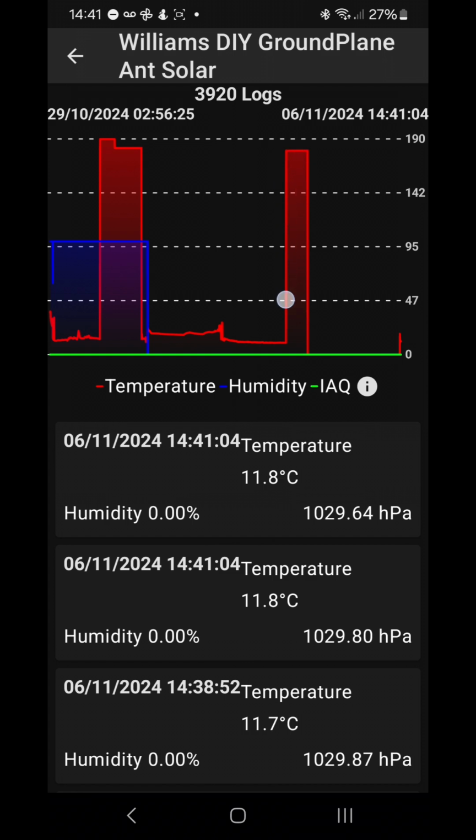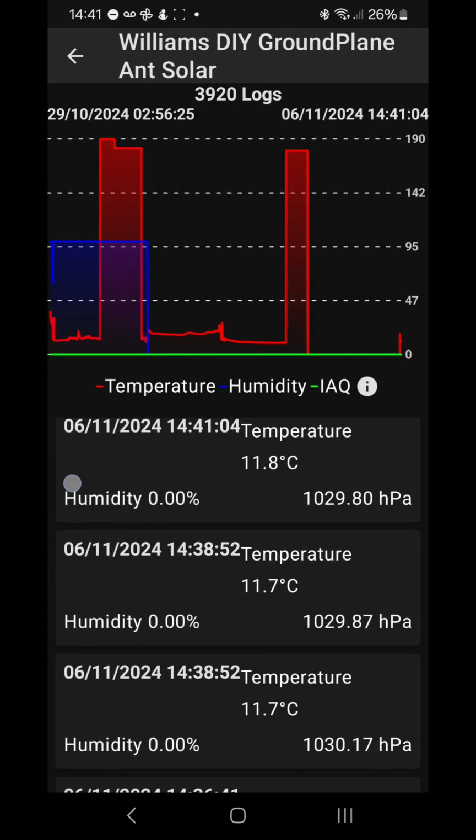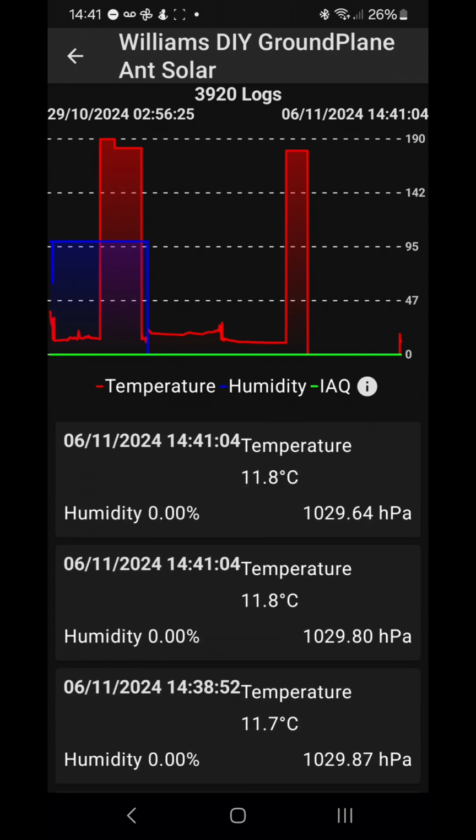And that, oh, it was the corrosion, wasn't it? Sorry. So it was either water inside the sensor or corrosion between the resistors. Probably the corrosion between the resistors. Well, I've cleaned it up now. Sensor's coming back up, so it's not broken. It just needed a bit of love, that's all. Yeah, I'll get some conformal coating and work out how to measure high humidity. It's a bit of an awkward one.